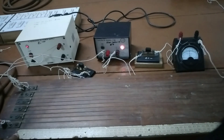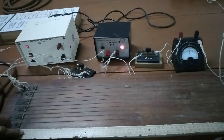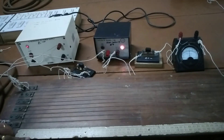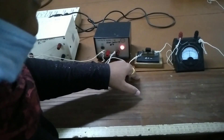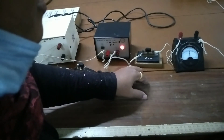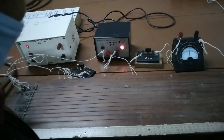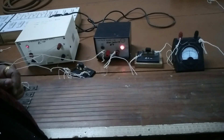The scale goes from 1 to 100 on each wire. For odd-numbered wires you read the upscale, and for even-numbered wires you read the downscale. The zero of the galvanometer lies on the sixth wire, so use the downscale with a small ruler. The downscale reads 38.9, giving a total balancing length L naught of 538.9 centimeters.